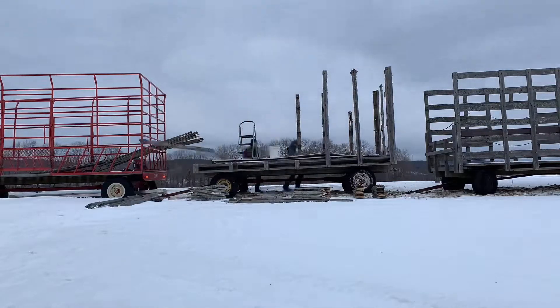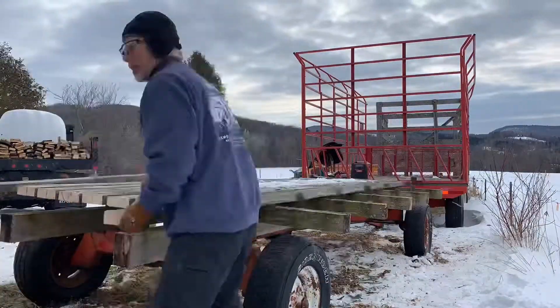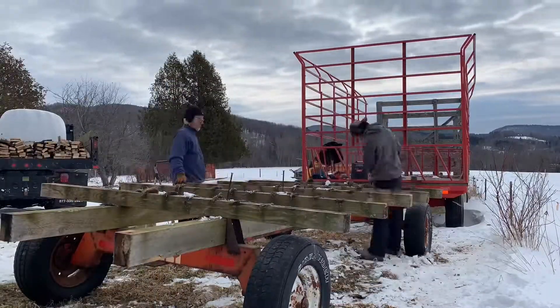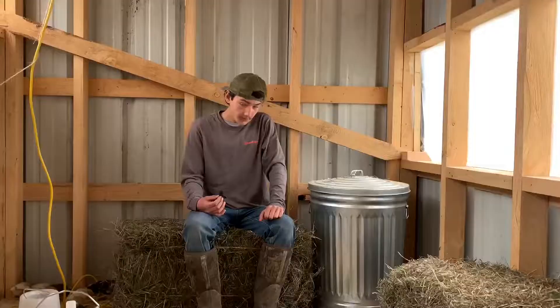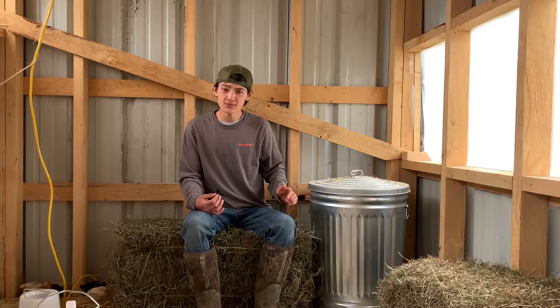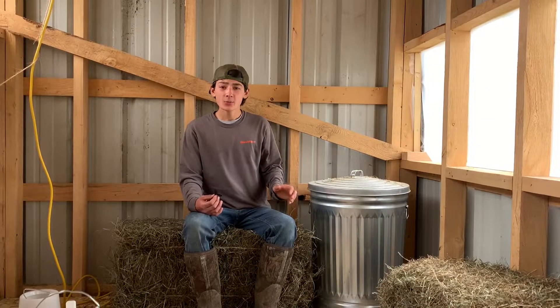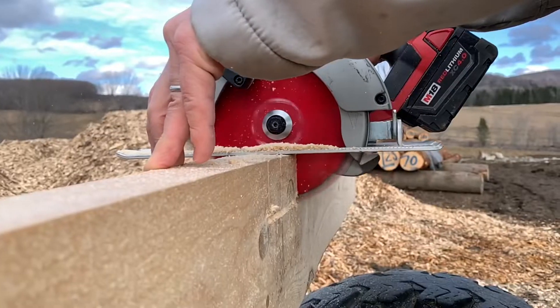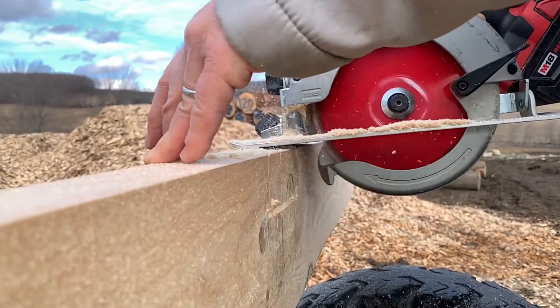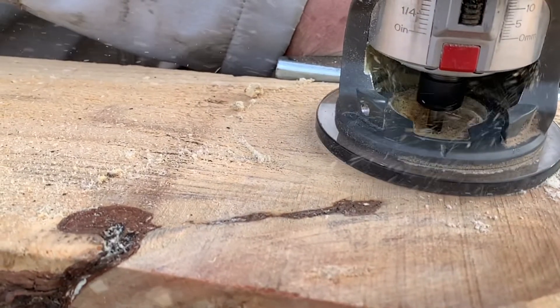Taking apart the hay wagon was pretty intense. We stripped it down to the 4x6s that sit on the frame, so we could put our 2x6x8s in for the floor joists. This was on February 21st, so I'm a little behind making this video. Over a month later, on March 26th, we started the floor. Laying the floor joists was pretty hard — we had to notch out each one. They were 2x6s, notched out 2 inches to only have 4 inches above the 4x6, so it wouldn't be too tall. Basically we shrunk it 2 inches.